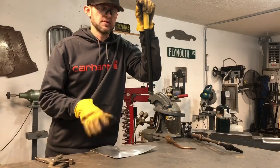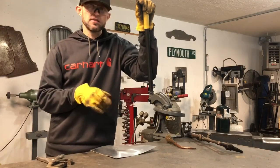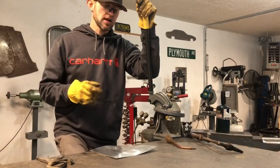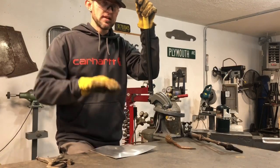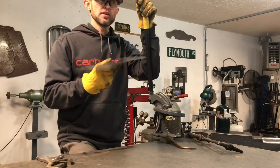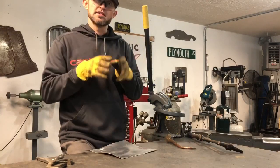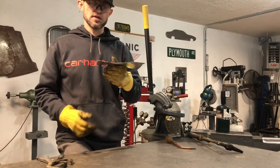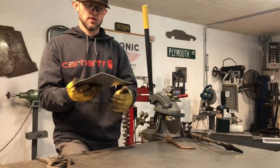If you're getting tired just beating the crap out of it and not getting to the shape you want, this makes the material more pliable — you can bend it by hand. It means less time in the English wheel, less time on the beating bag. I'm not saying to anneal a flat panel just to put a bend in it — use a brake and it'll be fine because you want it as strong as possible. But for beating it into an egg shape and then English wheeling it to get a teardrop effect, when you stretch it and create a convex shape it makes the panel stronger.